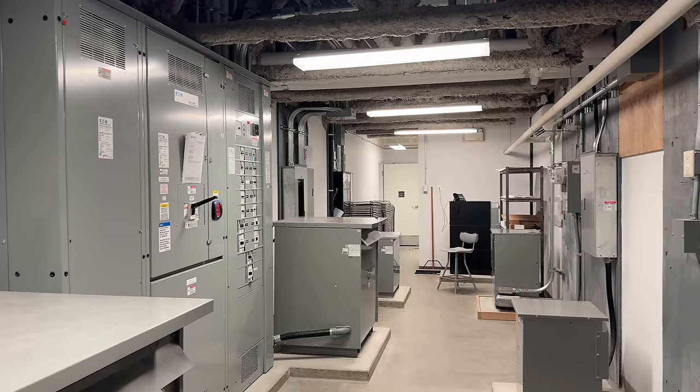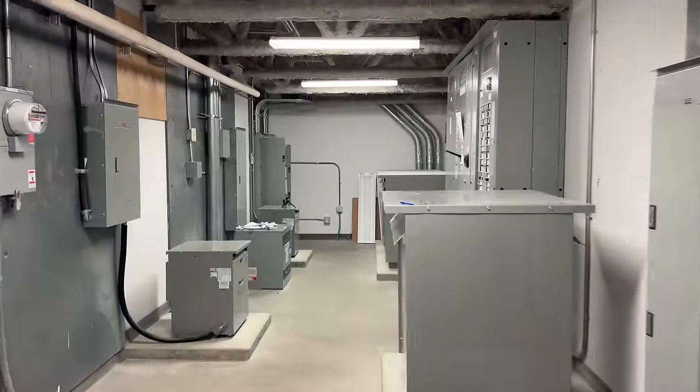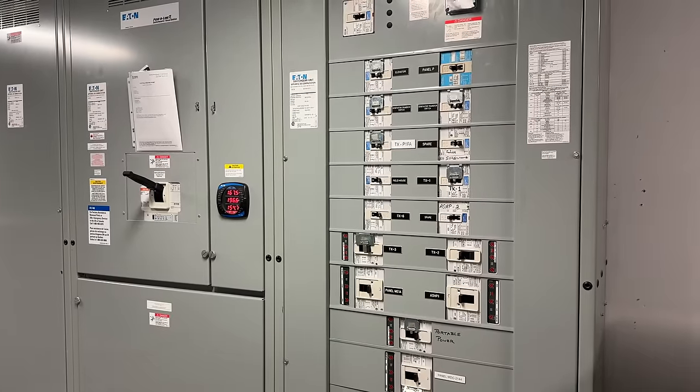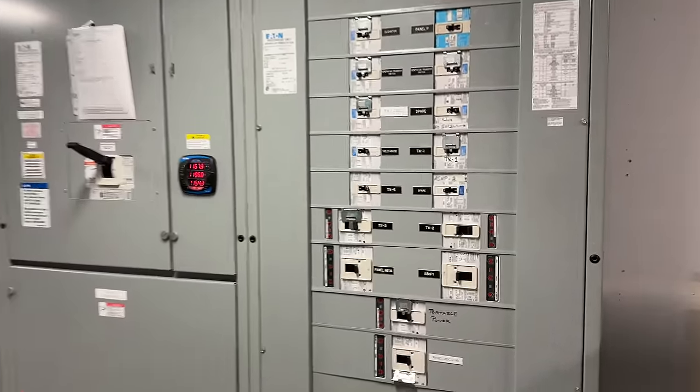That's about all there is to see. The system does start up pretty quick. It does have that three second delay — you want that three second delay because you don't want the power dropping out for one second and turning over your generator for nothing. My generator at home I have set even longer, for 10 seconds, but mine's not emergency life safety power. This isn't life safety power in the medical sense like you'd see in a hospital, but it is still life safety providing emergency lighting and your critical smoke control system. I am now going to restore utility power and the generator will enter a period of waiting to make sure that power is stable before transferring back to utility.